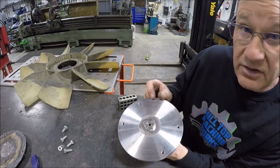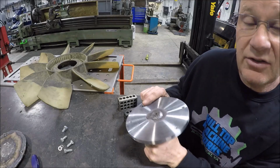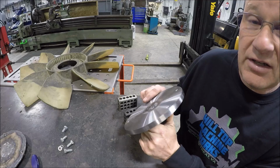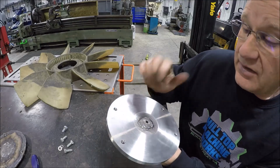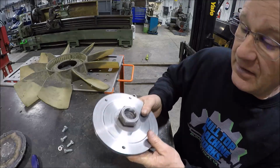A little reverse turn in there with your tool upside down makes it kind of a little bit hairy because you just can't see what's going on. You don't know if you're breaking chips good or if you chip your insert. So you kind of gotta hope for the best, I guess. Listen to what's going on, but this thing rings like a bell. You can't really tell like your normal turning, right? And everything was going good.